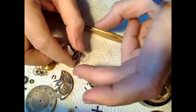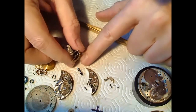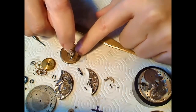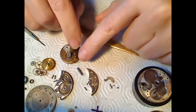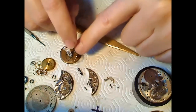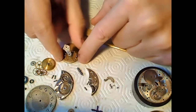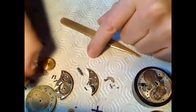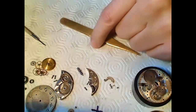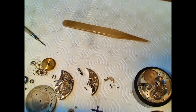Before I close out, I want to have a quick look at the pivots on the balance to make sure they're still intact. They look like they're not broken, so that's good. I'm going to remove the balance stud and take that out, then wash the spring - I've got a fluid to wash the hairspring. Then I'll clean the pivots on the end of the balance, take the cap jewel off and clean that jewel as well, so the balance is completely cleaned and maintained. If the watch doesn't work after that there are bigger problems, but I think it was just significantly gummed up.